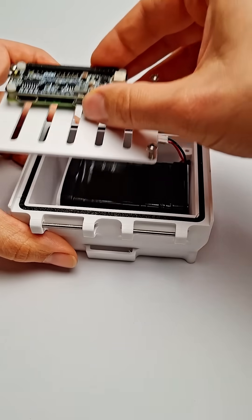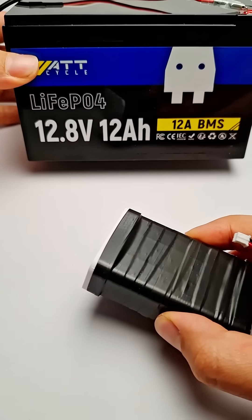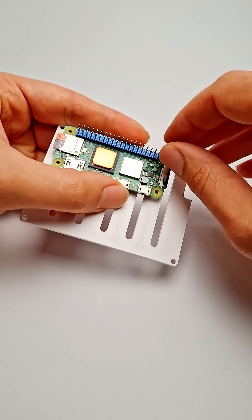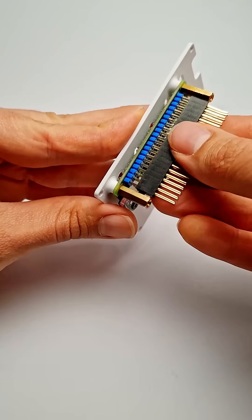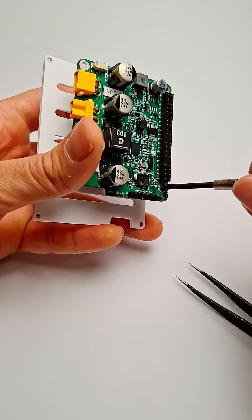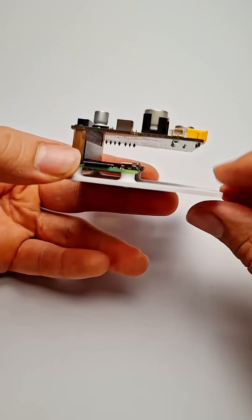The existing battery pack was just two 5 amp hour 21700 cells, but I want to use something much larger. Let's take off the WittyPi and mount the Pi Zero back onto the mounting plate just for testing. For mounting the PVPi we'll use standoffs and a stackable header to provide some space for heat dissipation. The PVPi is a full-sized hat so it looks a bit funny on top of the Pi Zero, but everything still works just the same.